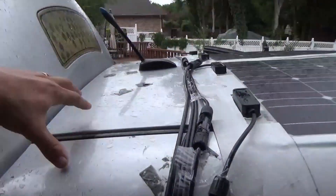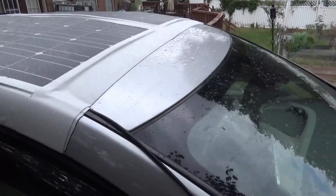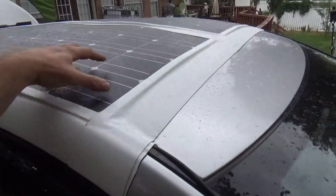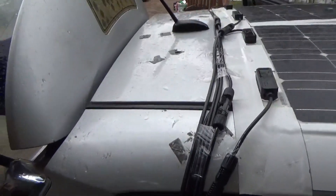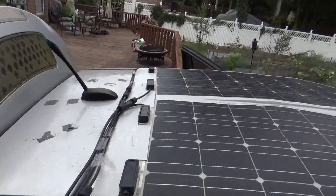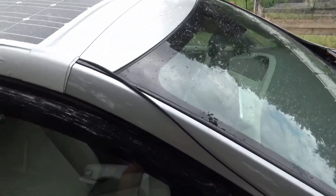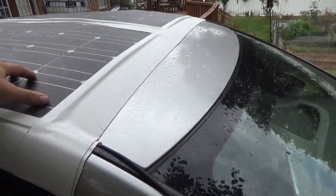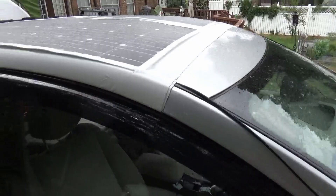This has freed up a lot of real estate right here, and we've got another patch on the front that's just wasted space right now. We can't take one of these pre-assembled panels and fit them on there — they're all too big — but I think I can figure out how to build my own panels. That'll add another maybe 150 watts using this area right here and the area in front, and that'll really be a game changer. Finding creative ways to use these little patches of roof real estate that you can't fit a conventional panel on — if we can make our own panels in any size we want, we can get enough power for this system to do some impressive stuff.